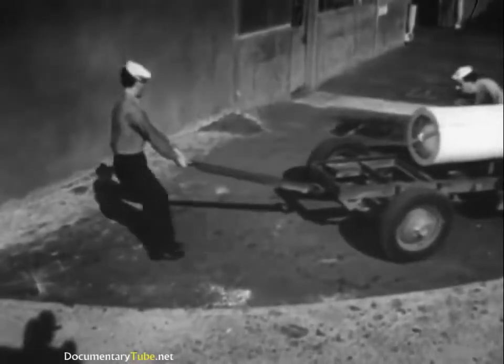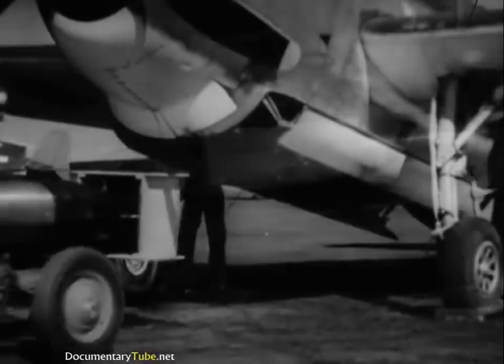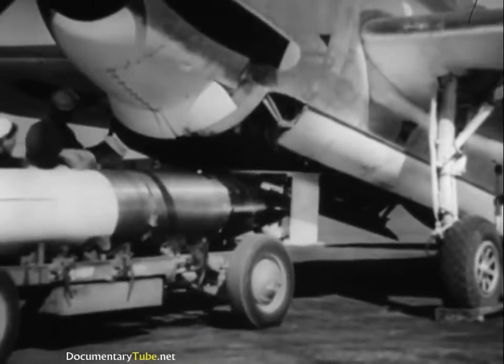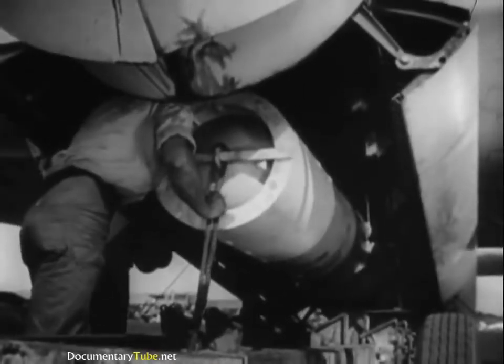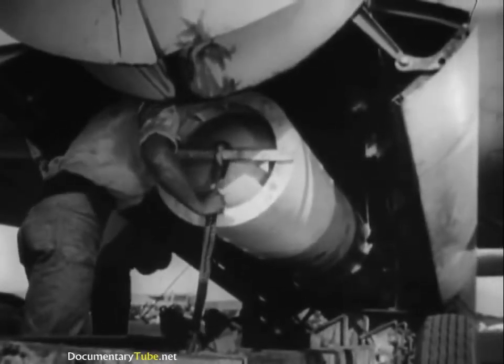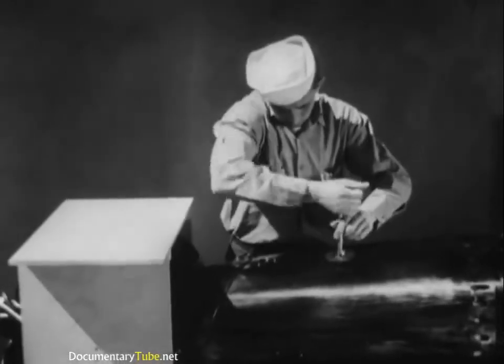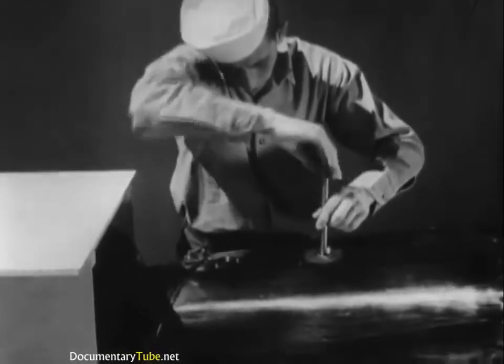With the new ordnance enforced, not only will the torpedo be more stable in the air and in the water, with no appreciable broaching or hooking, but initial dives in 85% of cases will be no deeper than 50 feet if the proper entrance angle is used. Remember that proper depth settings must be determined for the type of target to be attacked. This should be in accordance with tactical doctrine.